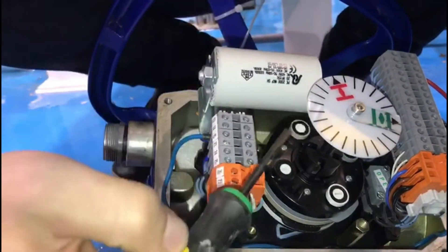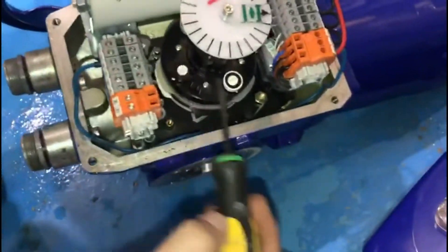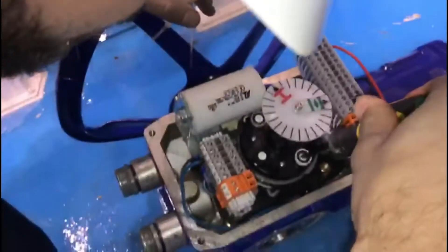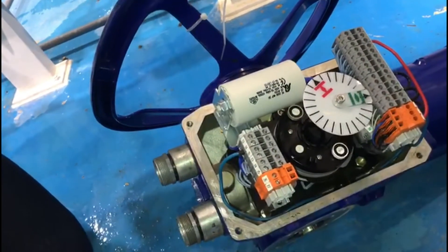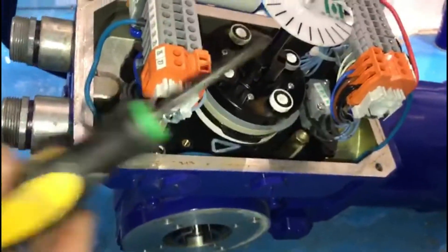To do that, you don't have to adjust the other ones, just the closed position. You have four — one, two, three, four. You can use the white one, the first one. Put your screwdriver like this, and you turn just until you hear a click. Now it's fixed.